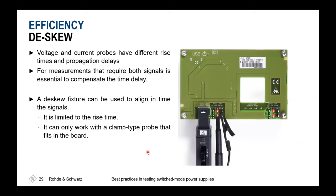If we'd like to do these calculations of the consumed power properly, we'll always have to know if the current and the voltage are aligned properly. So both of these probes, independent if it's an active or passive probe, all probes have a different group delay. Meaning we'll have to know the individual delay of these probes to have a proper alignment